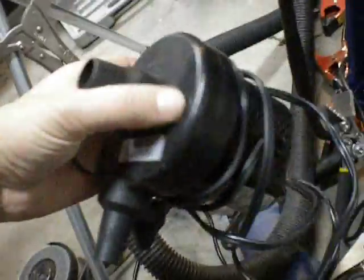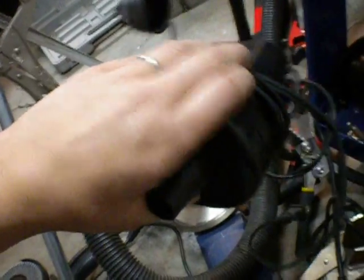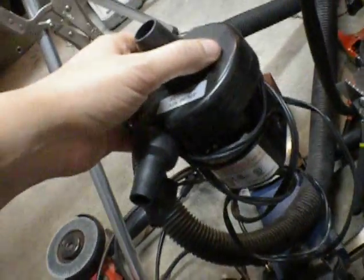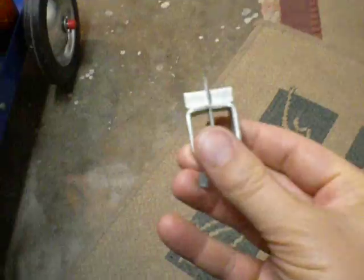This is actually a pump for filling up camping sleeping bags and stuff like that. Some guys cool their welds with compressed air, but I just try not to run my compressor in the garage at night because I've got kids and a wife. This does almost as good a job and is way quieter. These are little butt weld clamps — they hold the material together. And more magnets.